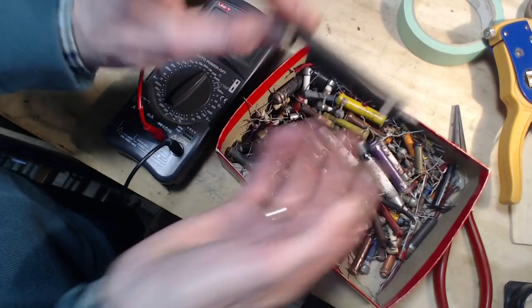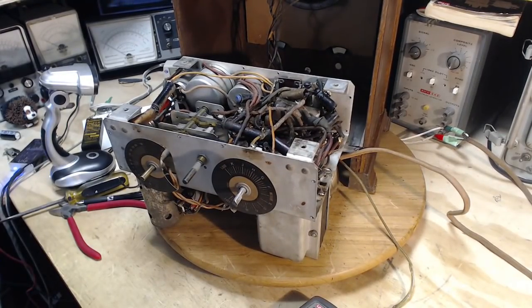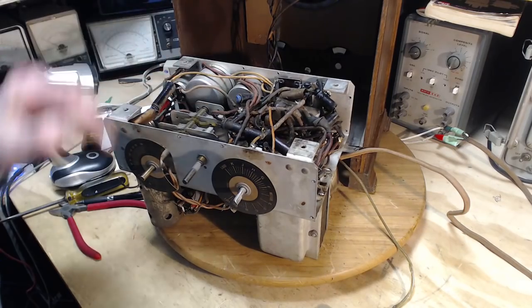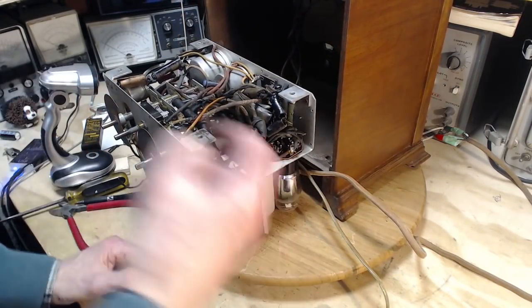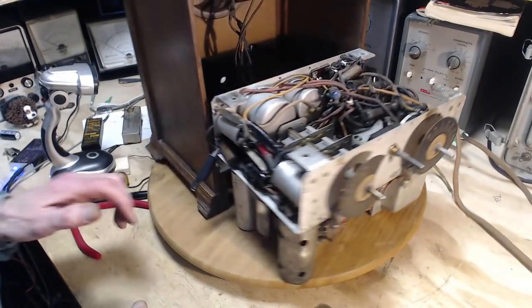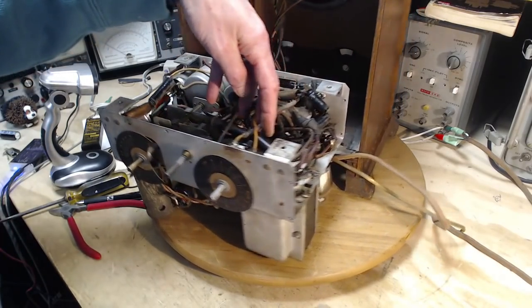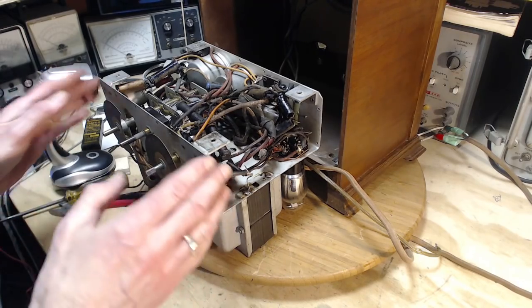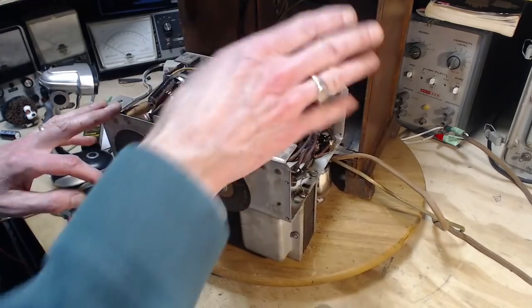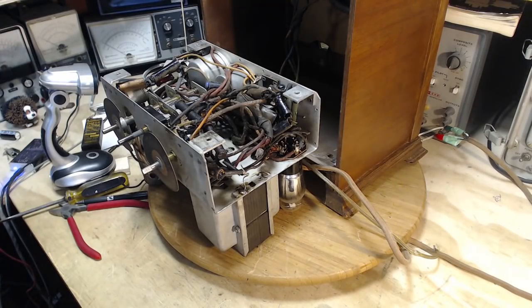So what that says to me in terms of this radio and all others with these dog bone resistors is: don't jump in there and start changing them all. Going in and doing that stuff — risky business. We're left with the three big capacitors I've taken out and a bunch of these horrid-looking things here. They look horrible, but they may not be. So the name of the game here is to put in four new capacitors, hook them all up — that's going to be a fair bit of work because the lines are running all over the radio. And probably play the radio after that and see what happens. Thanks so much for watching — we'll see you on the next video.